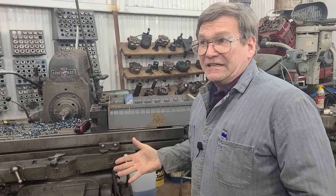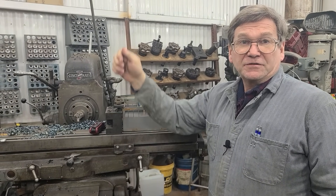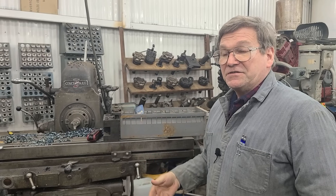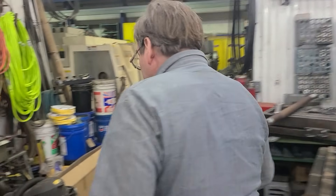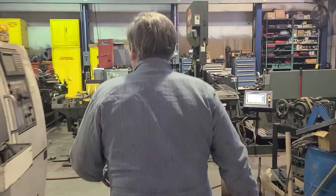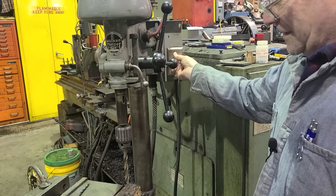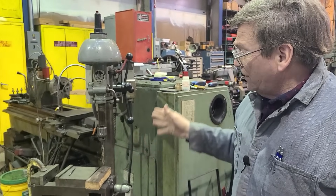On bigger machines, you also need it because the motor takes too much power to start if it's turning the machine. And it's nice to be able to control the machine starting up slowly. A lot of newer machines, even if they're medium-sized or like your CNCs, clutches are not really needed so much anymore because you have inverter drives or servo drives for your spindles on your CNCs. So you can start them up easily without any big distress — like that little drill press over here. We can actually turn it on, bring it right down to where it stops, and barely start it up. We can control it, jog it, add a jog-on button. You can do a lot of stuff electronically that before took a clutch.